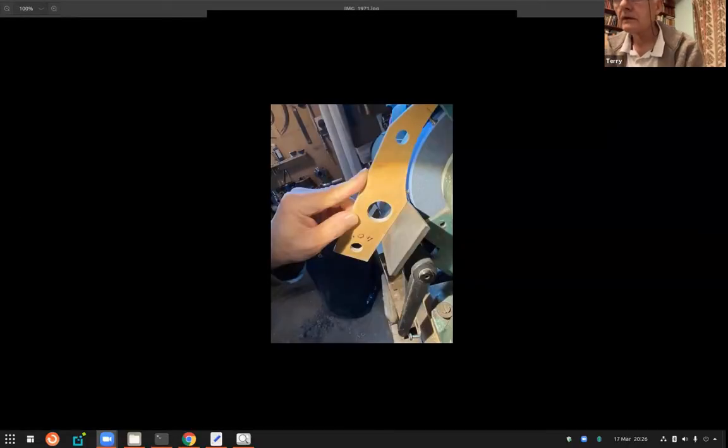That's the one. So all you need to make one of those is to put your tool rest, the platform, in the proper position for what you want, and you do that by trial and error, or however you want to do it. Get it right, lock it. Then you get a scrap of ply or MDF or anything, make a cutout. It has to have a flat edge, which will fit on the platform. You make a cutout which will fit the wheel, but you only want 2 points of contact on the wheel.